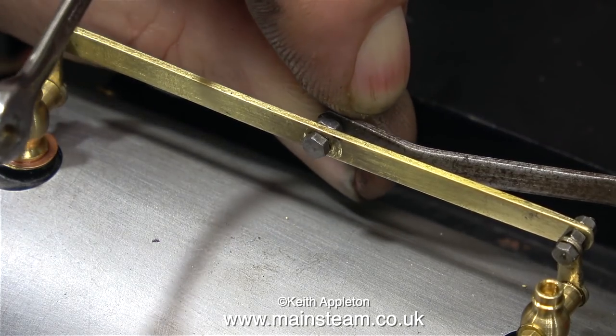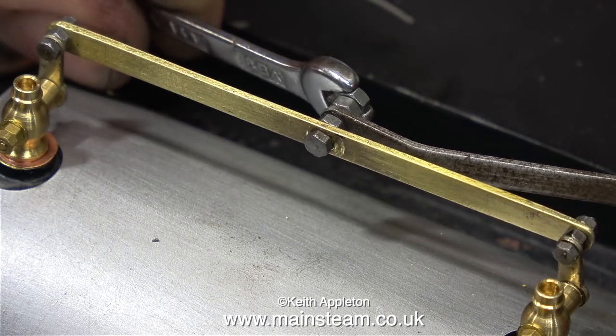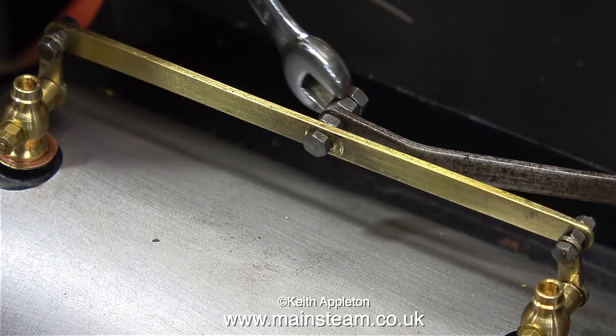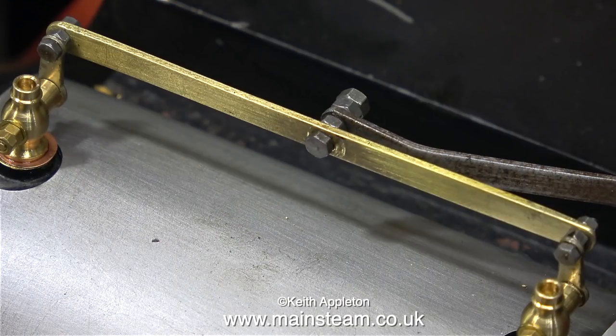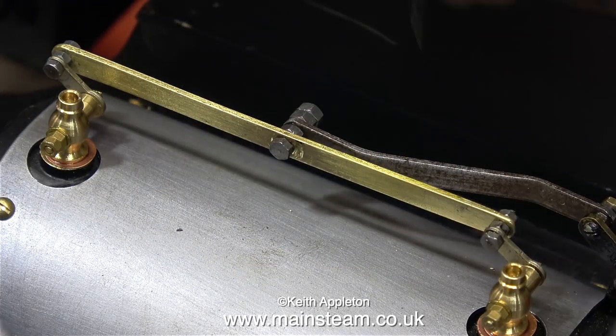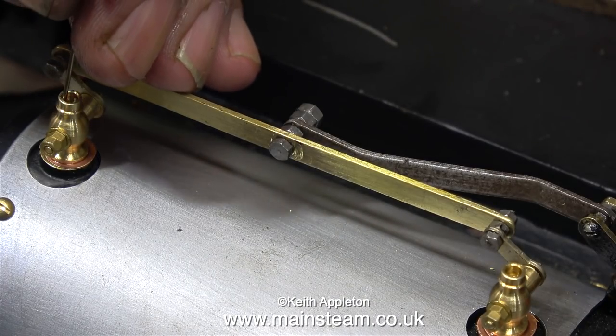As you've just seen, I drilled the hole about a sixteenth of an inch inboard at one end, then I rounded off the end of the piece of brass bar to make it match the other end, and it's now a fairly invisible repair - you can't tell it's been repaired. All I need to do now is reconnect the centre linkage, not forgetting the locknut. These locknuts are important because if you don't fit them and the linkages drop off, then the drain cocks are not going to work. I think it's time to get the glass headed pins out again - yes, this one's fine, and so is this one. Problem fixed.